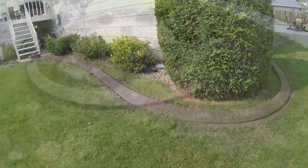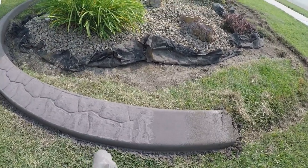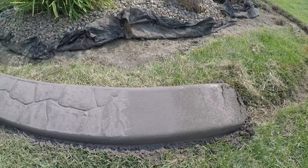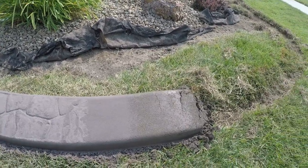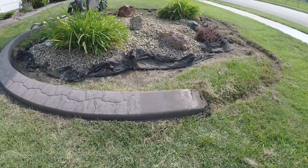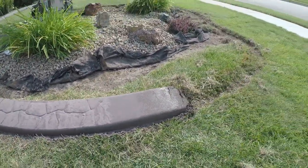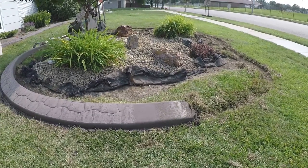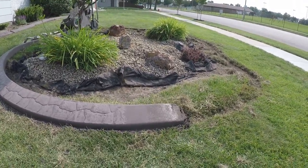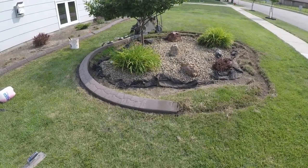When you're doing an island and you're stamping, you want to make sure that you leave all your powder and your stamping a little ways back — a foot, foot and a half if you can — because you're going to have to trowel all that right there. If you have powder on there, it's going to get really dark and you'll have issues with it sticking because there's a powder in there and it's kind of a bond breaker. So you want to leave that back a little ways. Same with the stamp — make sure you have the stamp a little ways back. If you have a really big island and it's really hot, put a damp towel over the top of that to slow evaporation so it's easier to take care of when you get back in there.